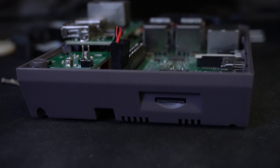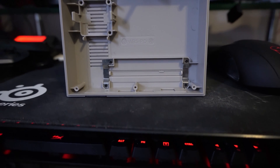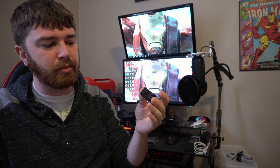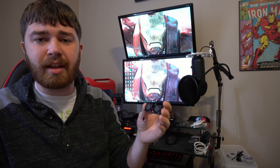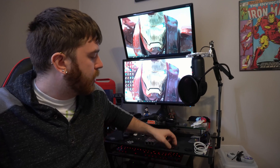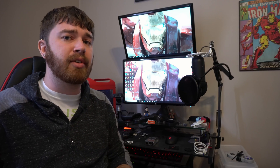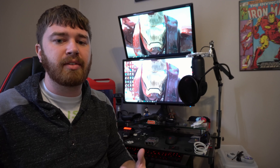There are also two GPIO headers — a positive and a negative — for a fan, which can be located at the top if you want to put one in. You can in fact use one of the dual fans for the Raspberry Pi Model 3, Model 2, and so on, and it does fit in this case assuming you align it correctly. It plugs into those GPIO headers and this drastically reduces heat output and gets airflow going. There are some minor vents so air has somewhere to go, mainly out the bottom of the unit. This makes a big difference when playing PlayStation 1 games, for example, because heat does build up on the chip.